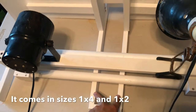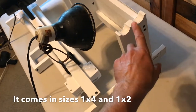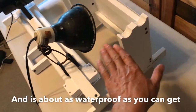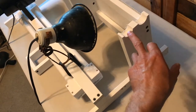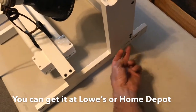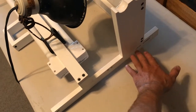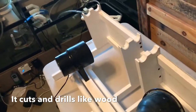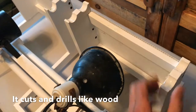I then made an additional two cross members, cut my side plates — these are nine inches high, I cut them at 18, used the hole saw, drilled those, then cut it in half so it gave me a half moon shape. I sanded these out a little bit so they perfectly contoured the PVC I was using. The side plates are anchored from the bottom with three inch screws through the one by twos, countersunk so they sit flush. I did that on all four, then cut four cross members to put across the back to hold the side plates nice and stout, anchored in from the side.